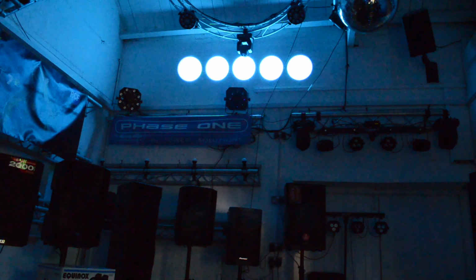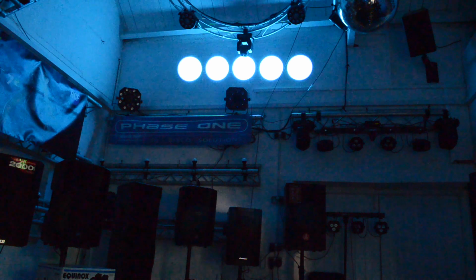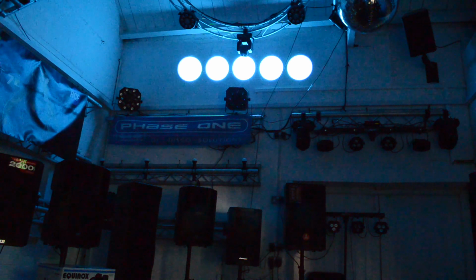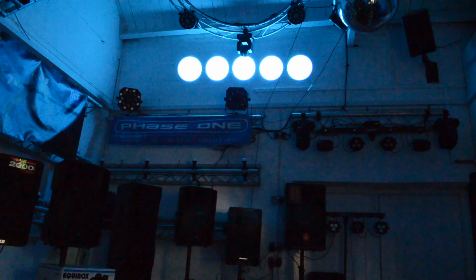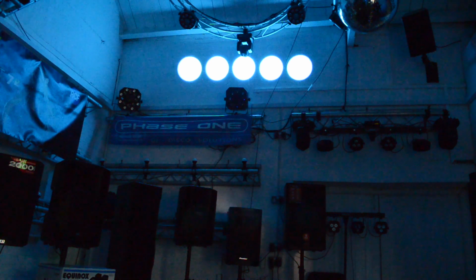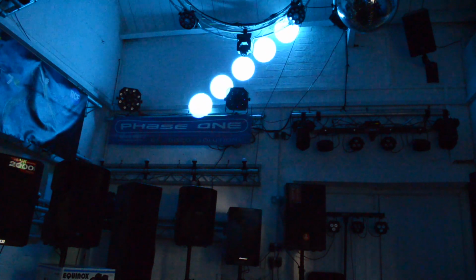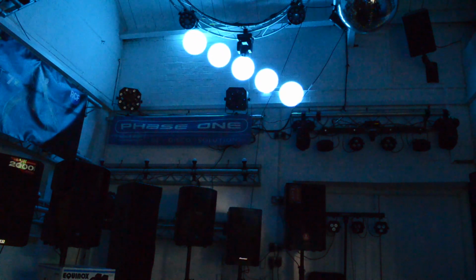and you wanted it to be absolutely level on the wall and you wanted to program this up via DMX, what you'd be able to do is index the gobo so that the gobo reads absolutely level and then save that as a scene. Now obviously when we go further up the DMX channel we can move it right round, so we could have it on an angle or anywhere, right?